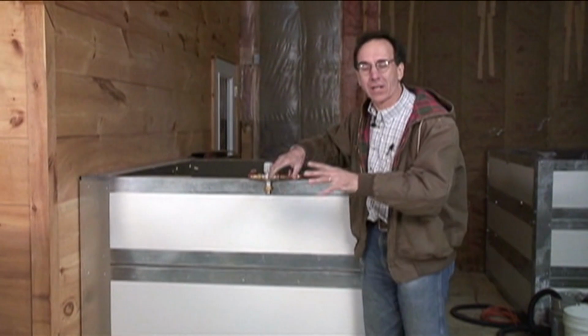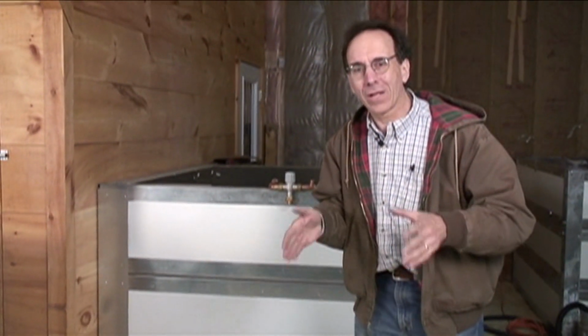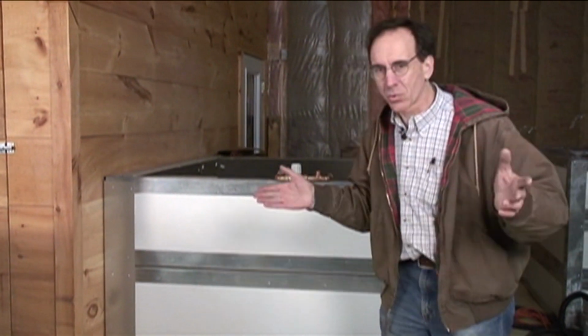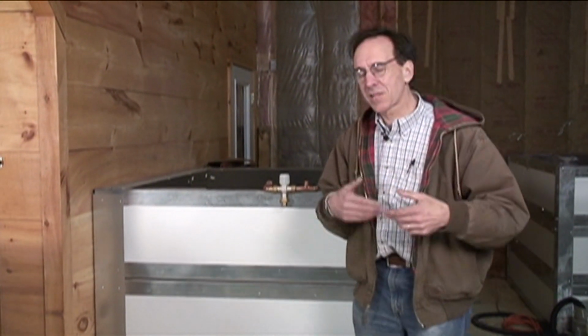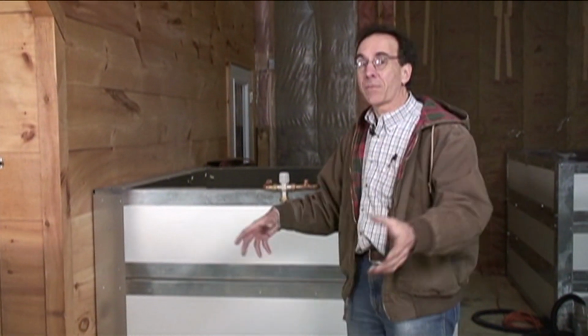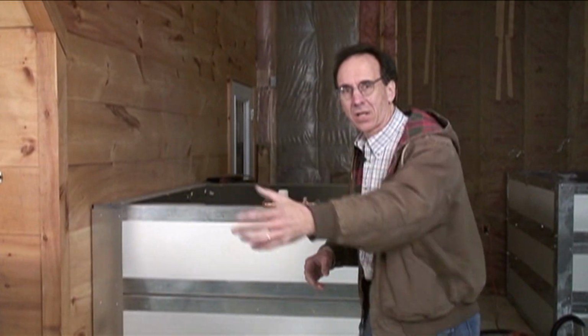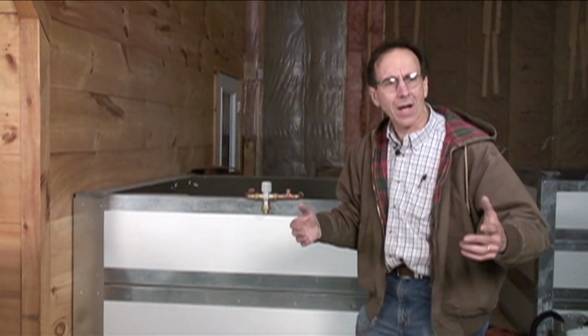So this is really like a highly insulated above-ground swimming pool for really hot temperatures. That's all an unpressurized tank is. Very simple, less expensive than a pressure tank, especially when you get into big volumes and you don't have to build your house around it or have the tank in a separate building. So once we do that, we've got the drain back, we're pumping water to the roof and back down again, and it's under no pressure, so we're just pumping tank water right out.